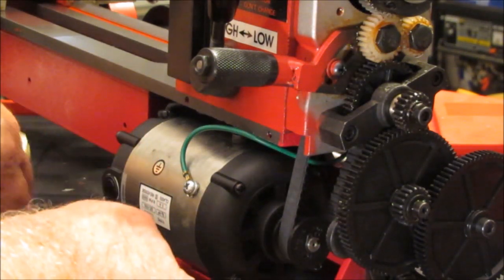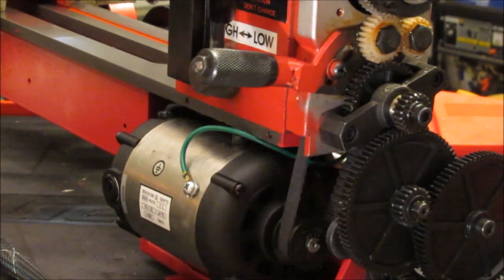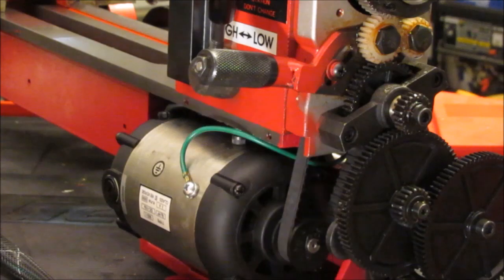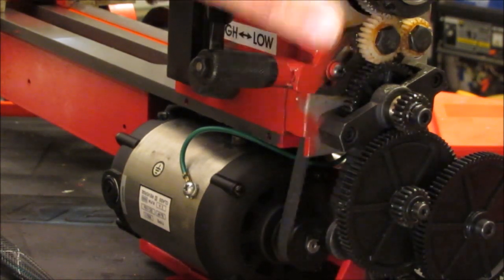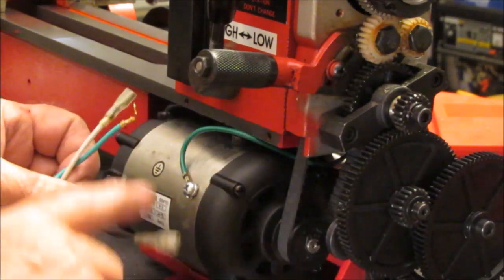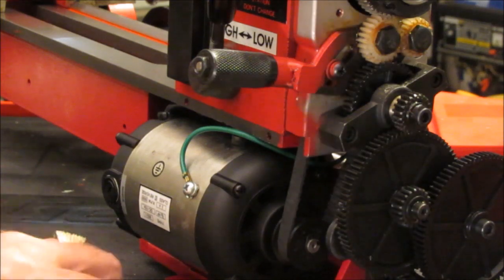One thing I want to mention, by the way, and I don't know if this is a good time to mention it, but the power for this box will not be fused. The fuse on the front panel, which is, I'm an electrical engineer, unorthodox in this country, and is not allowed, is that the fuse in this unit, in the electrical box, is in line with the neutral, and you should never put a fuse in line with neutral. You should always take the hot lead and fuse it. But it's China, and they exported these things into the country, and that's what they've got. They've got a fuse in line with the neutral.